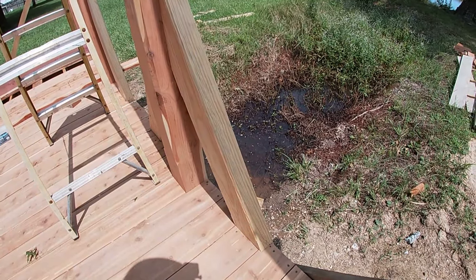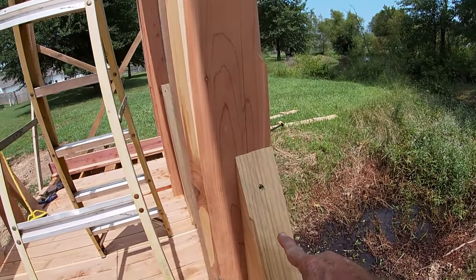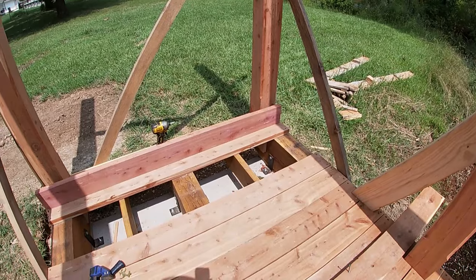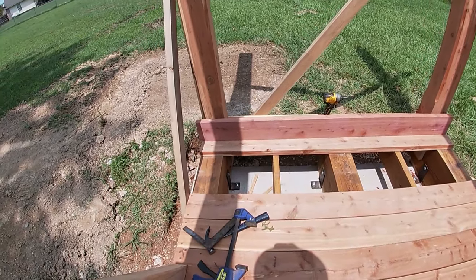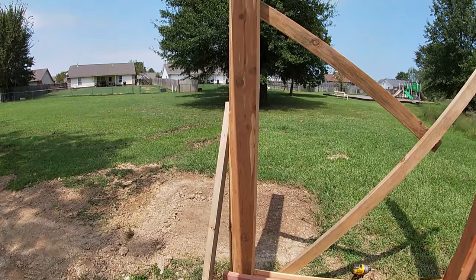They're anchored to the girder. Now I'm just temporarily putting these in with just one Torx screw. I'll come back and drill through here and put a lag bolt into the post itself. Since I've put everything down as far as the floor with Torx screws, I can really easily take them up, and the last pair of braces will go against this post